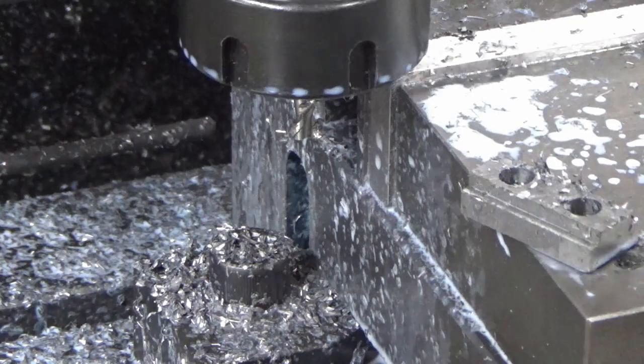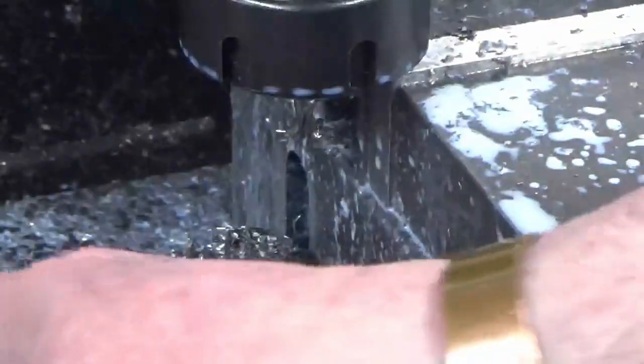So we just had to swap hands and use the slip jaws just to stop that curling round as you break out, trapping the slot drill and breaking the cutter.